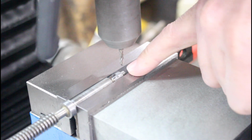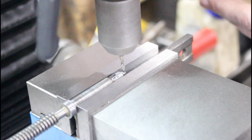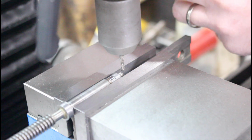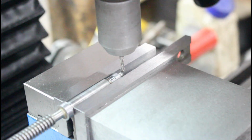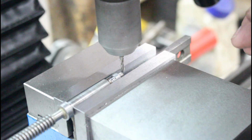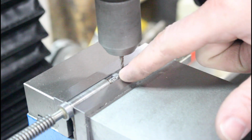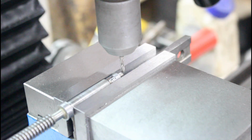I know from my previous ones that you end up cutting into the thread just a tiny little bit. We're going to go down, there's my zero from my previous spot, and I'm just going to go down a tad bit more. So I'm just skimming the top of that thread, and I'm going to end up cutting back into where my original slot was. I don't want to put another cut into that shaft, because although my new portion of my shaft is down in deep here, I want to keep as much tension as I can there so we can try and reuse that.